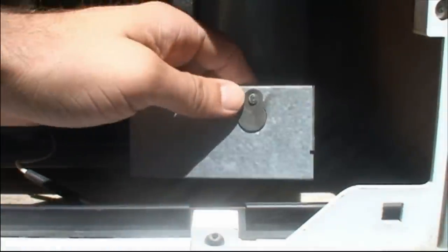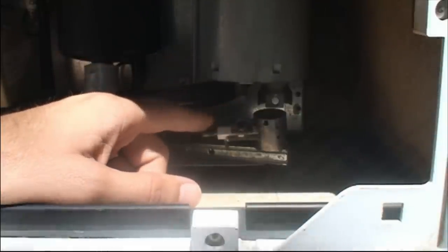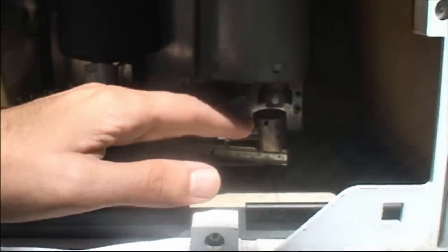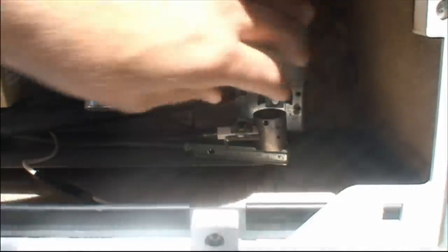So, one of the big telltale signs is that you may have an orange flame instead of a blue flame when you look in the little window. So, when this is on and you're opening this up and you look inside and say, the flame is orange, then you're probably not getting enough gas through or something's blocking you here. If the flame is blue, then, I mean, it still might be cluttered with debris or something like that. I've also had a friend who had something blocking in the chimney here, and he had to take that to the actual place for service for that.